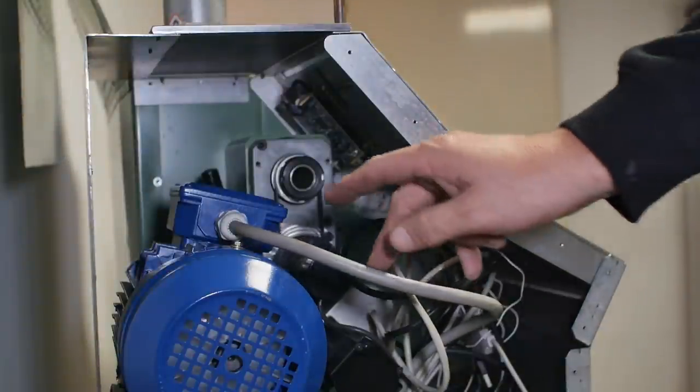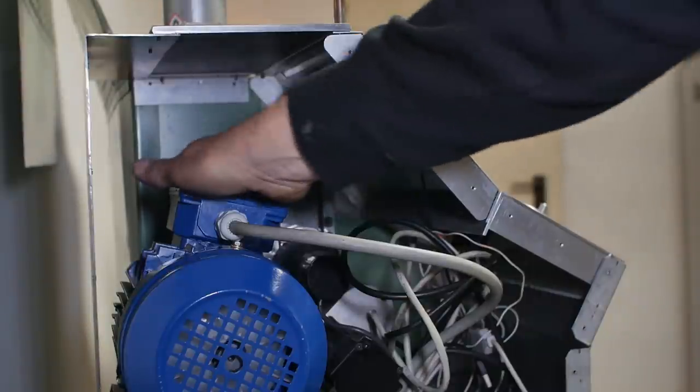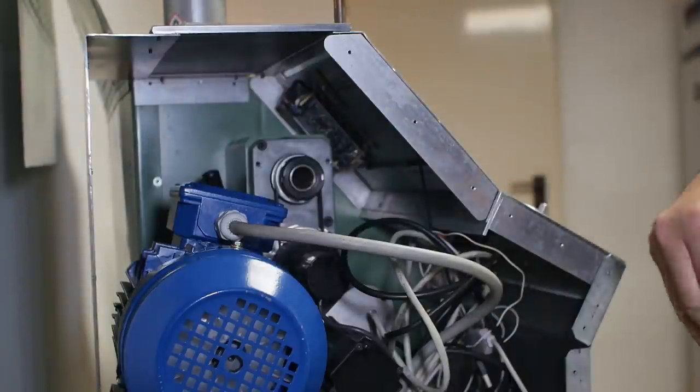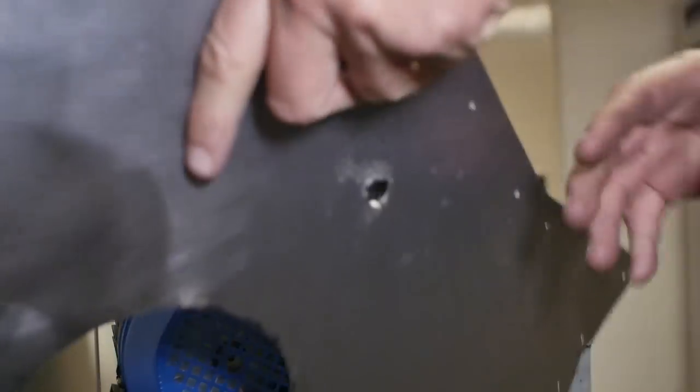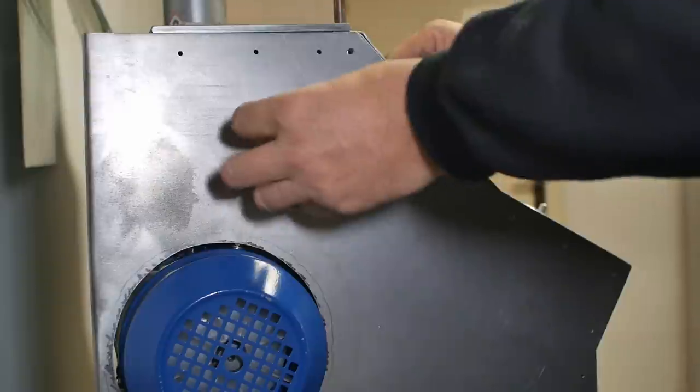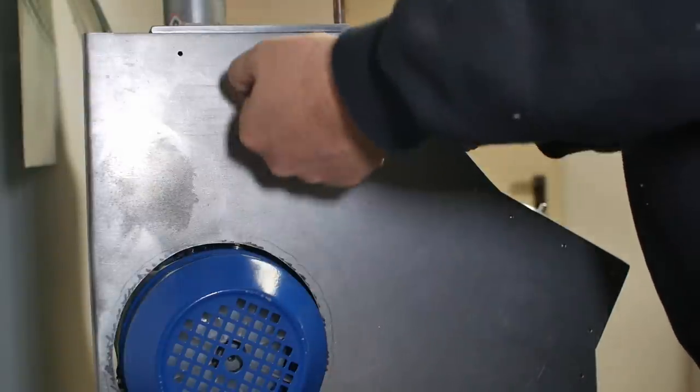And then the second thing I need to do is extend this gear change lever. I'll probably just put a fork and yoke on it, or the push rod, and then probably a hole here and just have it pull out for high gear, push in for low gear.